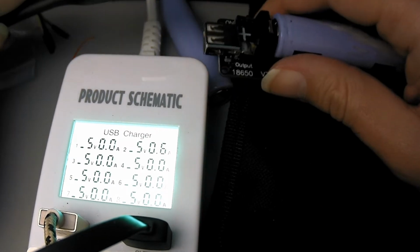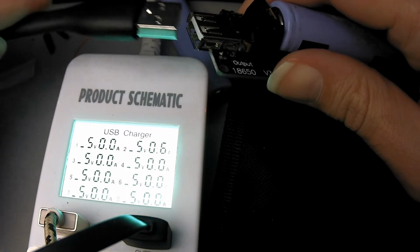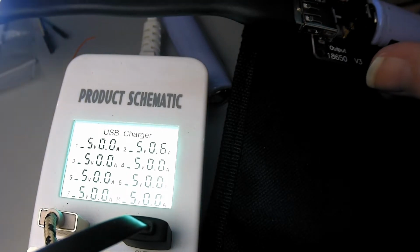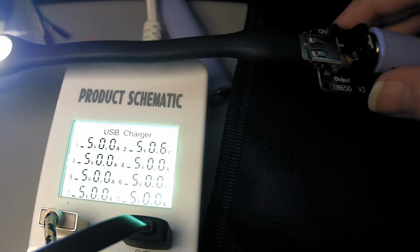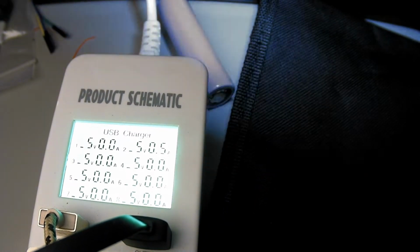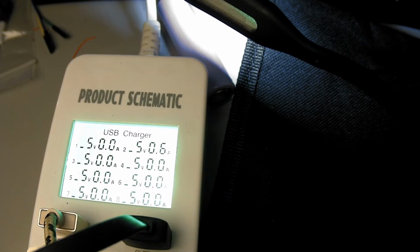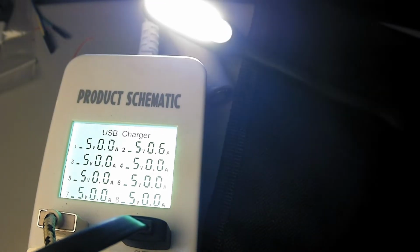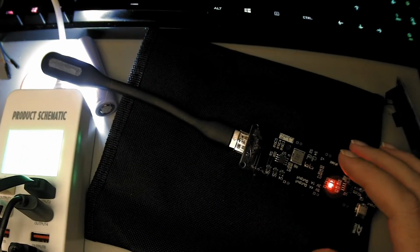But when we actually plug this LED in and then throw the switch so it's powered, we're essentially running off a battery. And there's really nothing in the circuit that is going to, I mean, it could have stepped up a little bit there. But my point is, in testing, running a Raspberry Pi, and I don't remember how much current it actually pulled, it's variable. You could be smashing the CPU in that thing and pulling a lot more current than normal.